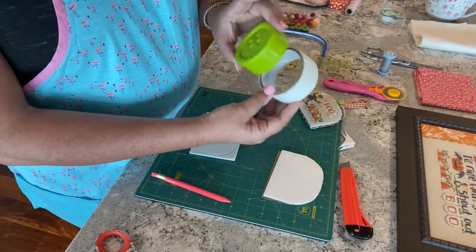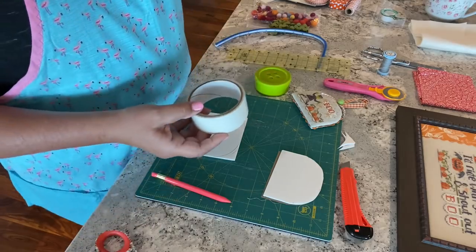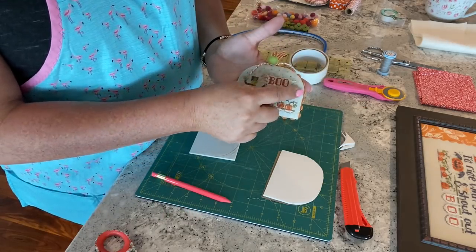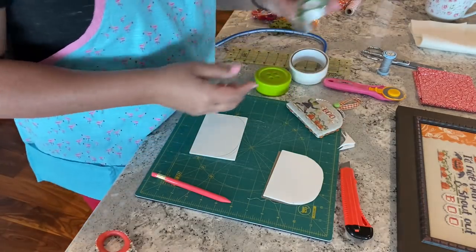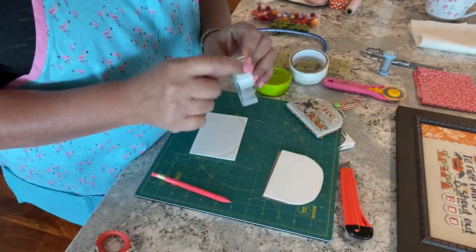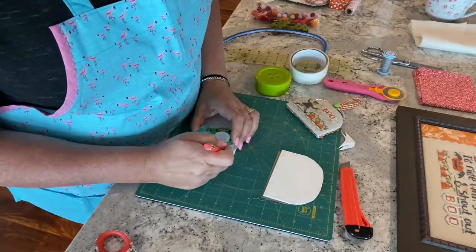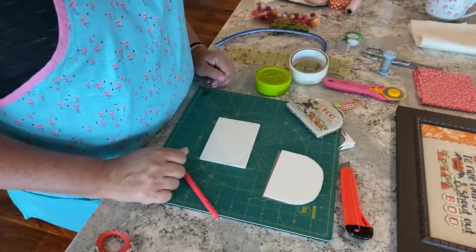You'd be amazed — a slightly larger circle might be better for your particular piece. You have to look at what kind of curve you need. I needed a longer, slower curve, not just a tight instant curve. I've also used the tight curve of a tape measure just to get a nice little corner. The trick really is getting those beginning and ending points, cutting one side, flipping it, and using that as your guide for the other side.